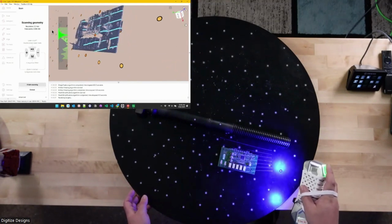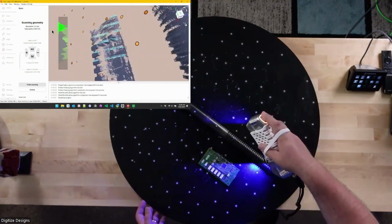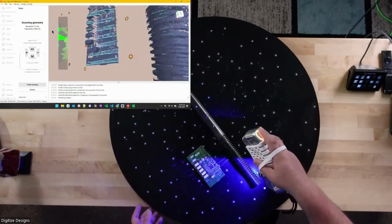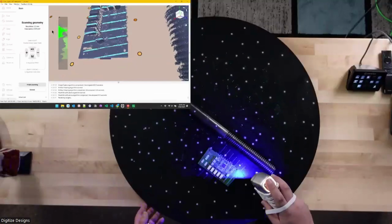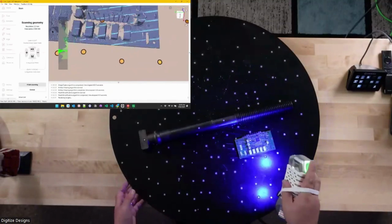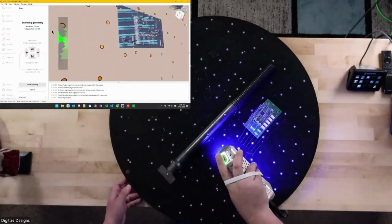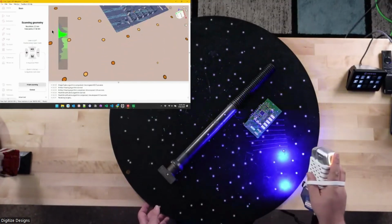Again, this is getting closer to the highest resolutions that this scanner is capable of, but we're still not there. If there's stuff on this that doesn't resolve, we've got 2 ways of handling that. We can start a new scan, crank the resolution up even more. We've even got refined scan, which is if you have just one area you need to crank the resolution up in, but you don't want to have to scan the whole thing again. You can do that in a specific spot and basically lasso select what you want to replace and double or quadruple or 8 times the resolution of that area in particular.